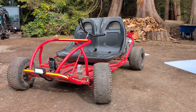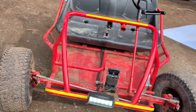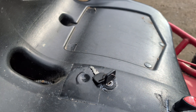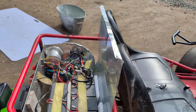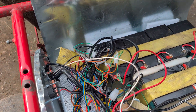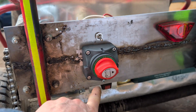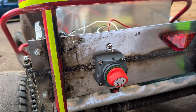Here's the latest development for the go-kart — I've installed a little floodlight up front. The accelerator works well, we have the forward/back selector installed, a key that turns it on and off, and a rear light as well. Unfortunately I had to hook up the front light separately as there wasn't enough amperage from the controller. On the back I have a little selector where I can choose battery one, battery two, off, or both.